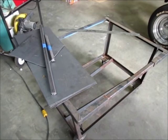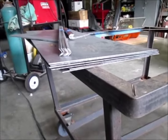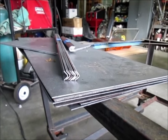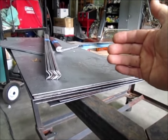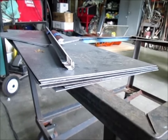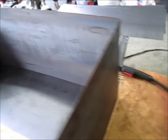Like I said in my update video, I've got multiple pieces of 14-gauge steel and these little angle pieces that were made for me. The toolboxes will be 34 inches wide, 14 inches tall, and 12 inches deep. I'm going to use these angle pieces to make the flange so that when the door shuts it has an overlap, and I'll show you that as I move along.